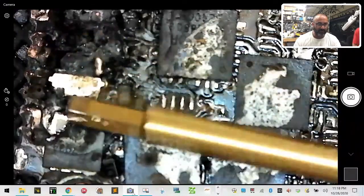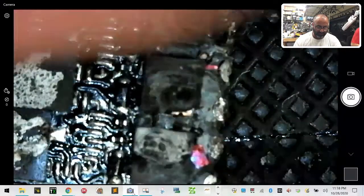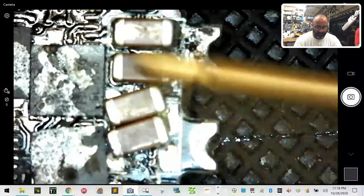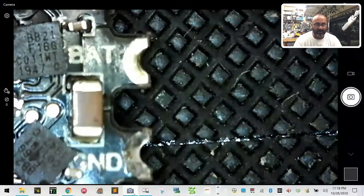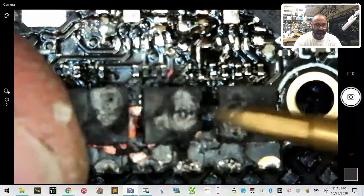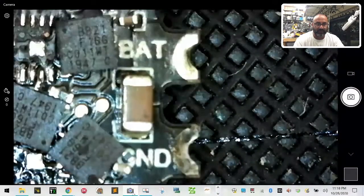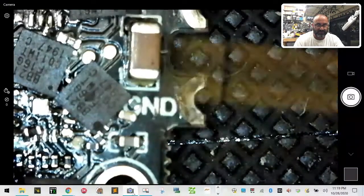The funny part about this is this fits the USB port perfectly. Now look at the other side though — the other side's not as bad. Everything's there, everything looks intact. Now look at the plugs. I'm not seeing anything that shows fire back here at all. I see heat, and I can see fire maybe coming on this side, but nothing here. I see items that melted, but the damage is on the edges and not anything — we've got extensive damage with definite burn marks on the edges, as if they were grounded. On the back I don't see anything. These caps here usually go pretty quickly — these are the first ones to go — and they're still in place. So the heat source isn't coming from this side at all.